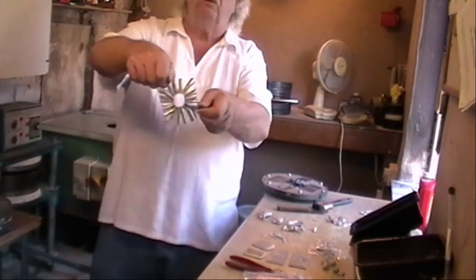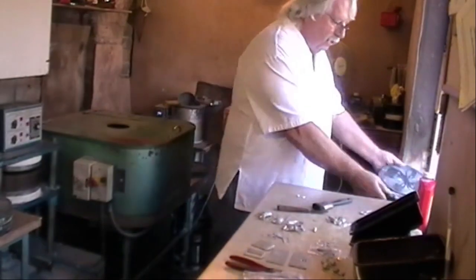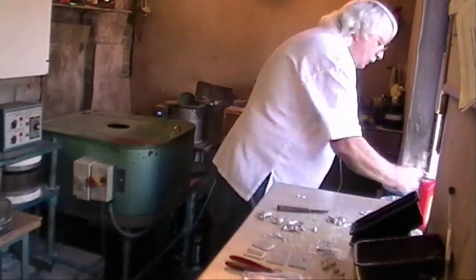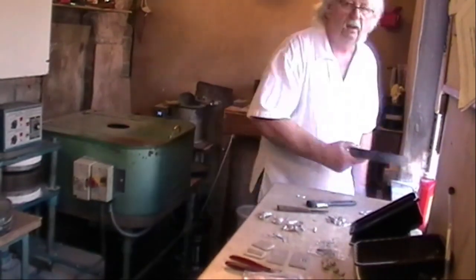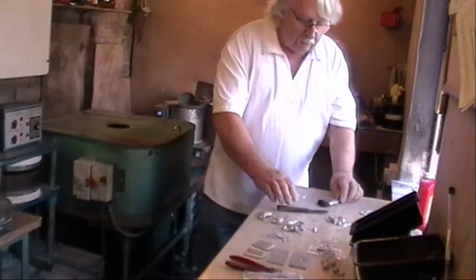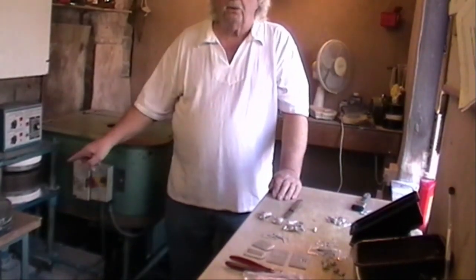And there you have, so we said, ouch, ouch, that's hot. That goes back in your pot. That goes on the windowsill. You talcum powder it. Give it a clap to dust off. Back down underneath, ready for the next sequence, and round we go. And that is basically the process of casting. Once we've made our mould,